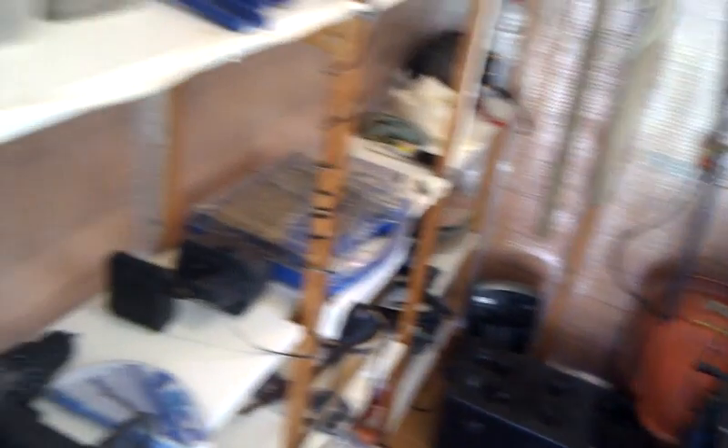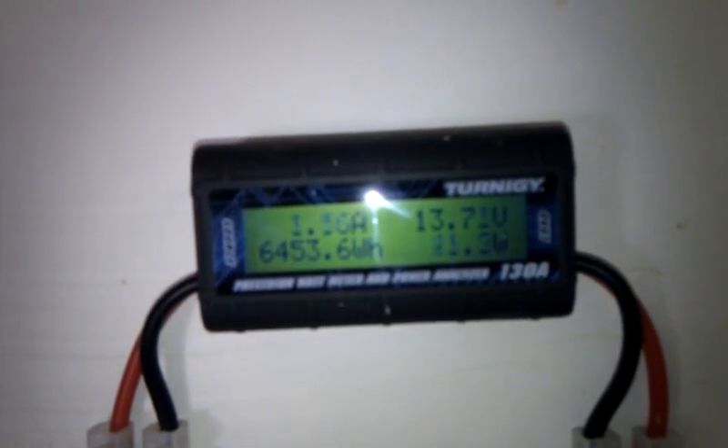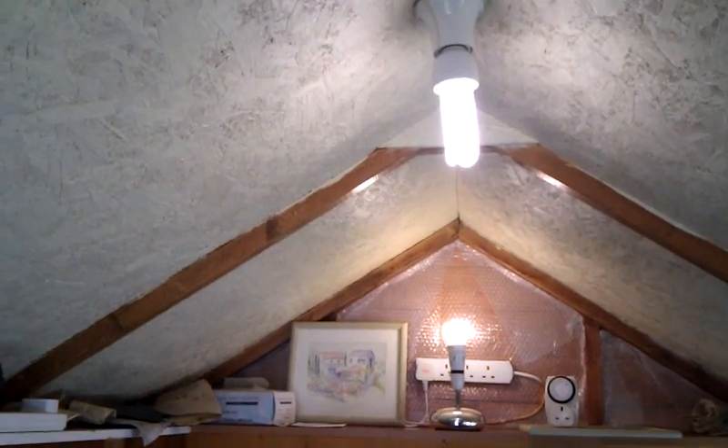I can only think it must have been dead when I bought it, or just didn't have much life left in it. You can see we did have a low voltage show up at one point, but generally it's not bad. About 40 watts coming in right now, but literally that's because the charge controller is just flicking on and off because the battery is full. I'm just running these lights for the video, just to burn up some excess power.